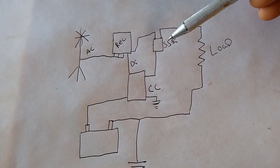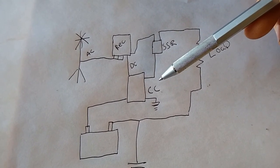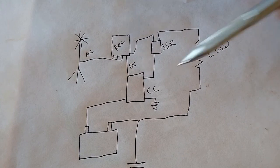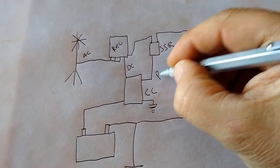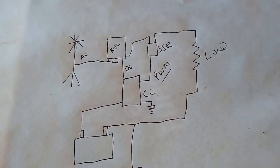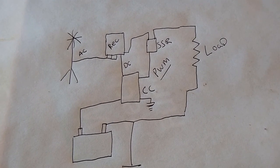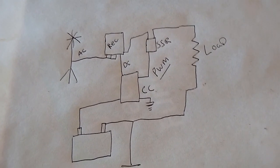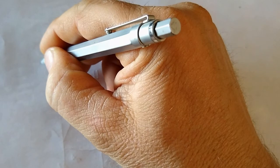Now it doesn't just do that like an on-off switch like a regular relay — the solid-state relay reacts really fast, and because the charge controller is capable of outputting a special signal, it can be more like a dimmer than an on-off switch. That's called a PWM signal, which stands for pulse width modulation. What that really means is it actually varies the width of the on and off times — the pulse.